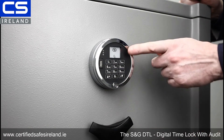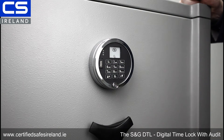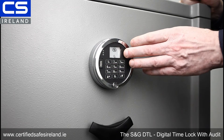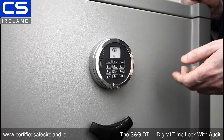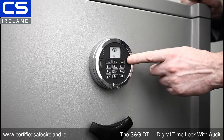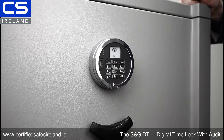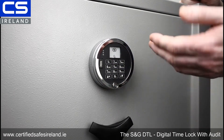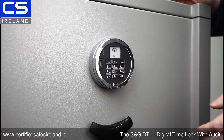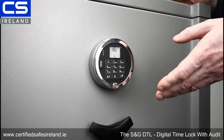One, you may notice the large e-ink screen. I've been waiting for something like this in a lock generally because e-ink is a fabulous technology for locks. It allows you to display symbols and words you can see from a much greater distance, and e-ink when it's displaying a symbol is not using power. They've managed to make a much larger screen that can give you full English words, so if someone's using this lock and programming it, it's explaining to you on the screen in plain English what to do next — like press this button, enter this — you can't really go wrong. It also allows us to display some very easy to understand symbols, which I'll show you in a second.